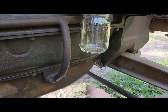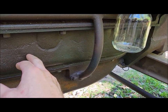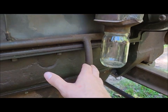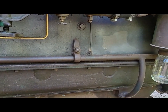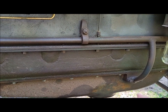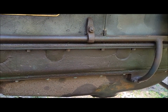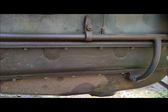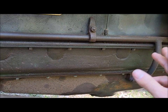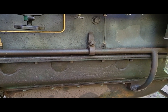On a 28 and after, that's completely different. There's no idler, I don't think, in the mid pan, and the oil line and everything is different. So basically you have to keep all those parts together on a tractor. You can't say put a 27 engine with a 28 pan and stuff. You have to keep all 27 parts together or all 28 parts together. To my knowledge, you can't mix and match any of that. I suppose anything can be done with enough ingenuity, but it's easiest to keep all that together.